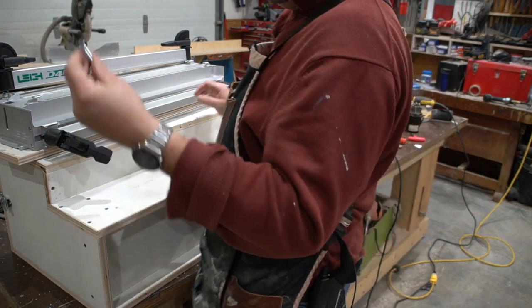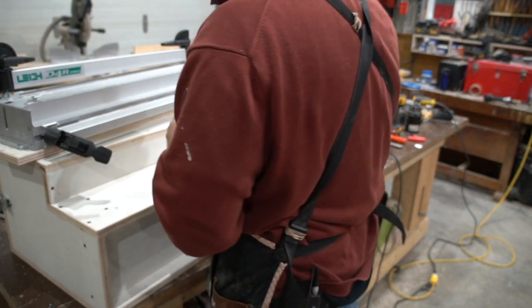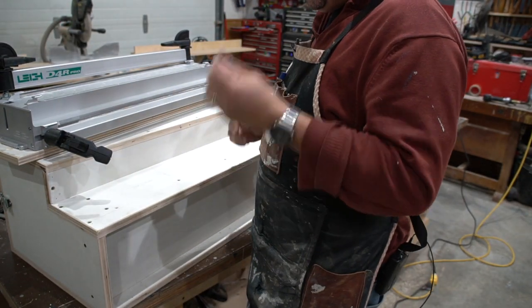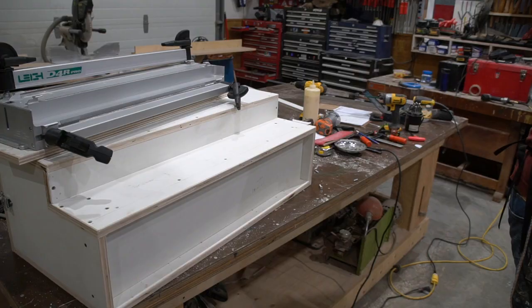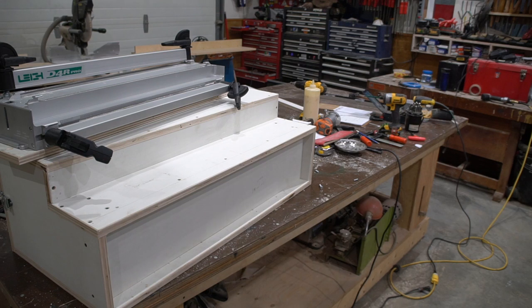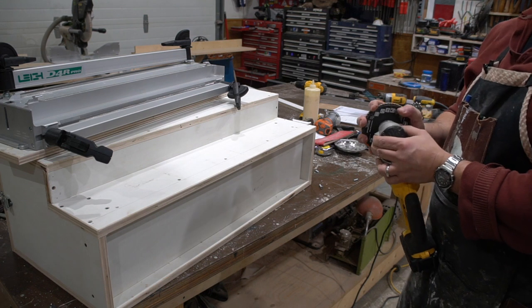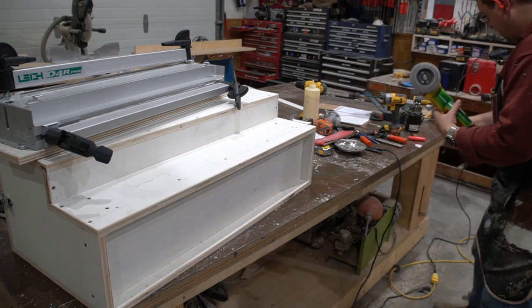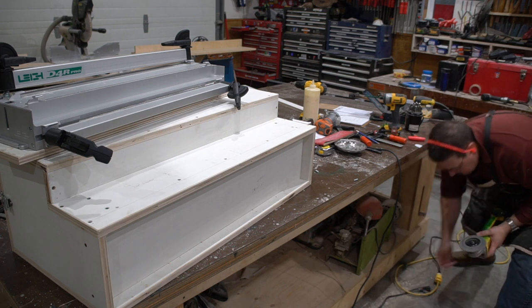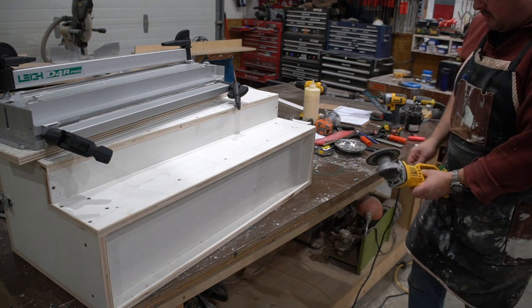These are too long — much too long. I'm going to turn off the camera and cut them down. What I did off camera is cut those bolts using a cut-off disc. Instead of putting a nut on and wheeling them off, I take a grinder, grind a chamfer around the cut end, and then the threads will thread normally. It can be quite quick.